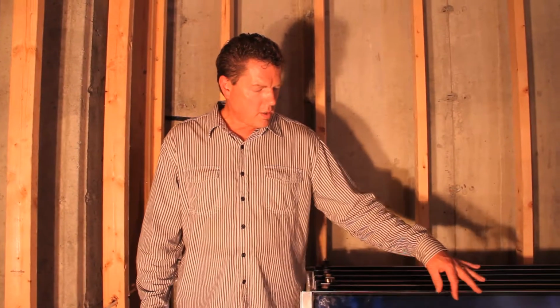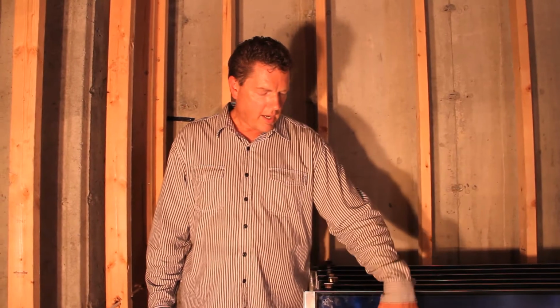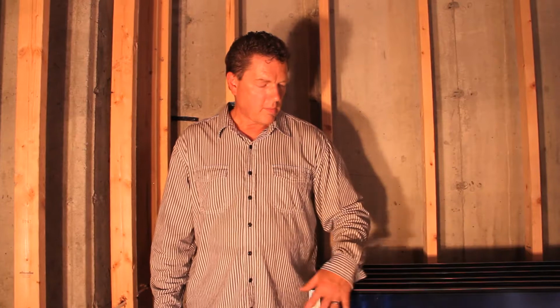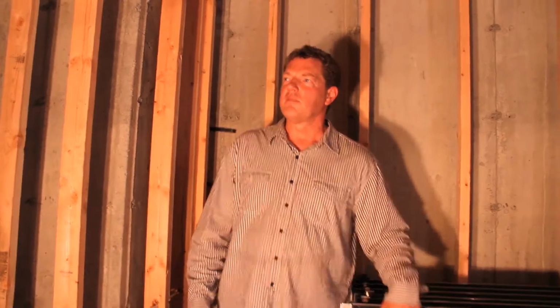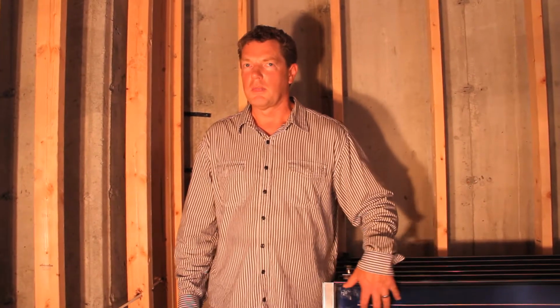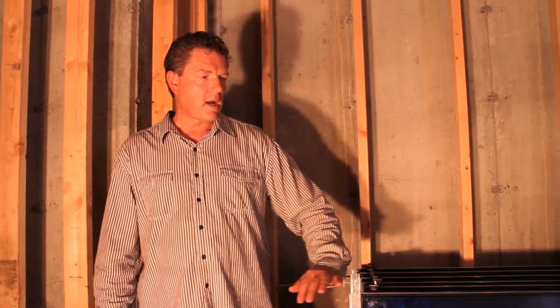This also creates what we call a thermal barrier. It has a dead air space inside. So this glass is over a copper core medium with a flat black paint painted on it. It's actually a selective black coating. It's a selective black, and what that means is it picks up only the infrared spectrum of the electromagnetic frequency that the sunlight puts off. So it increases the efficiency by about 1 or 2% over regular flat black paint that you could buy, let's say, at Home Depot.